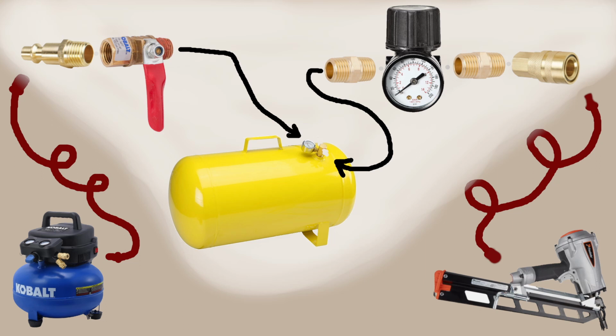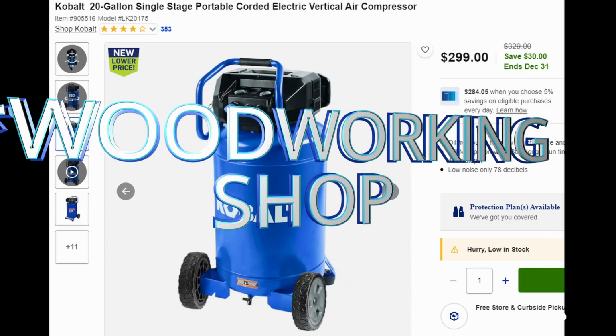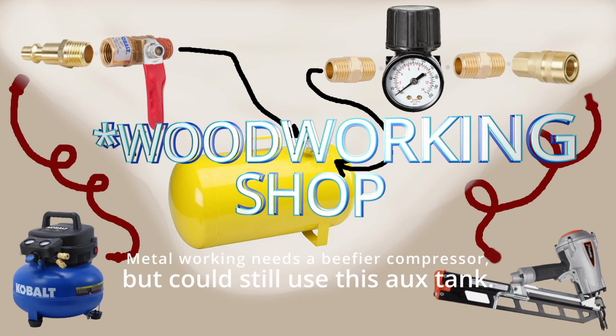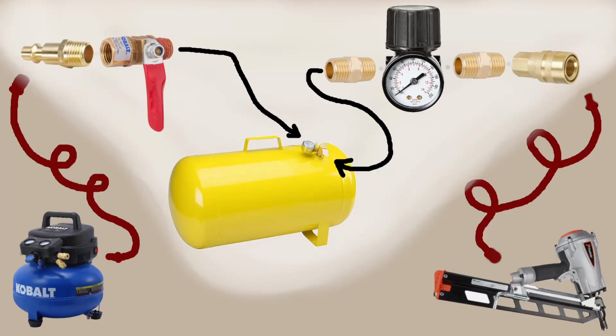There's a lot of benefits to this versus buying a bigger compressor, in my opinion, and especially for a shop. You can hide the compressor, you can insulate it, you can put it in another room, or put it outside for that matter. You can build a doghouse for it, put it outside, let your neighbors deal with it, and just keep this auxiliary tank inside with the regulator where you can tune the pressure. So I hope everyone takes this into consideration if you're running into similar situations with the compressor.